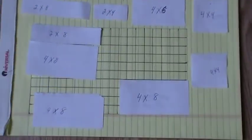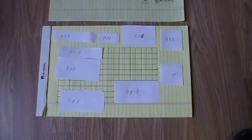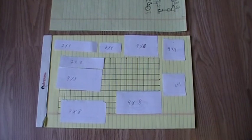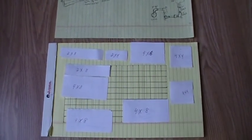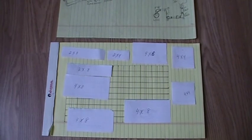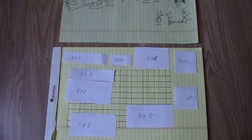The next one is I drew a grid pattern for my roof, and this is just one half of the roof, and I made little pieces of paper showing the different sizes of board, so I can try and guesstimate how many boards it would take to cover the space and which ways I would have to cut them to get them to work for the way I want. Because my roof is not just 16 by 16, which would have been easier, since I'm adding 1 foot on each side for the gable ladders, the extensions over each of the roof, it adds 2 feet, but when you add a foot, when everything else is 16 on center, it actually messes up your measurements.